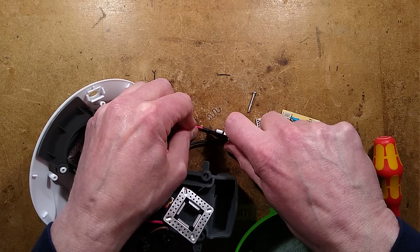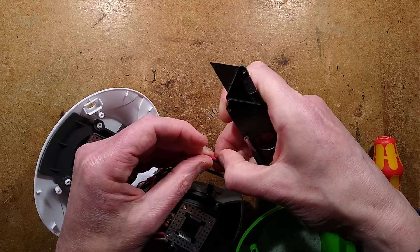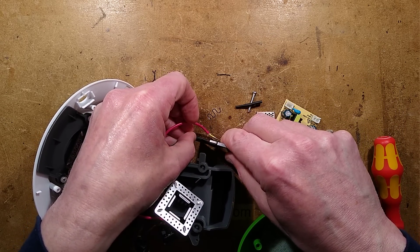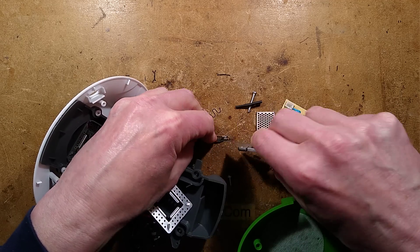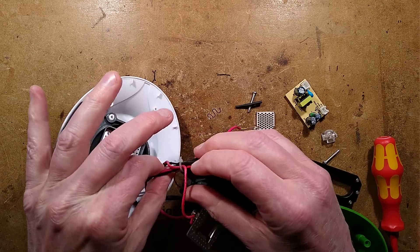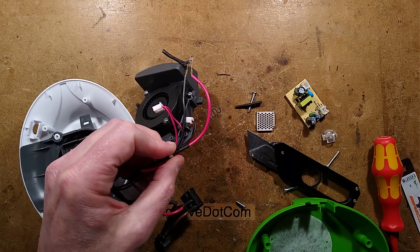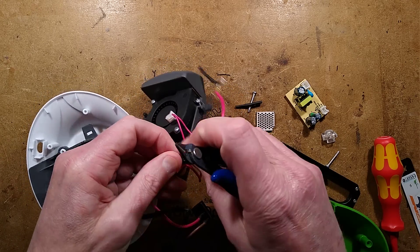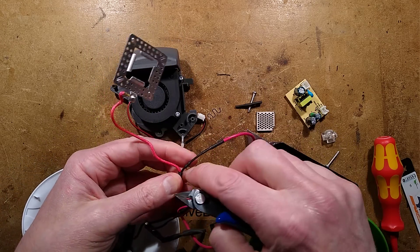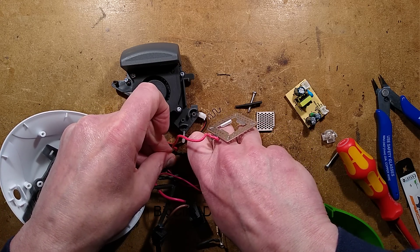Let's slit this open since it's defunct now. I'll get the cover off. Has it got a diode in series that would reduce the dissipation in the resistor? Nothing under there. What about under here? Is it just a resistor in series and an LED which shunts the other half of the sine wave? No, nothing there. So the resistor is in line - there's the resistor, maybe two resistors. Let's just keep taking things apart now because it's dead - it is toast. There is a little joint, a cord connection. It is just a resistor. That's it. Let's see what condition it's in.